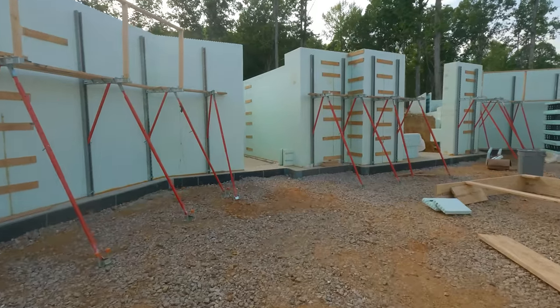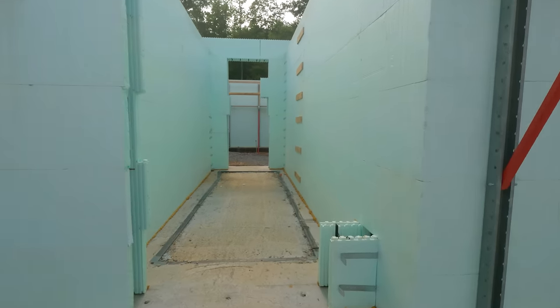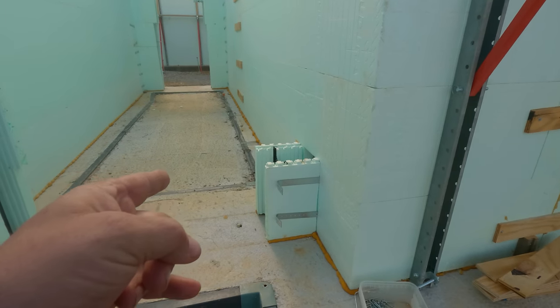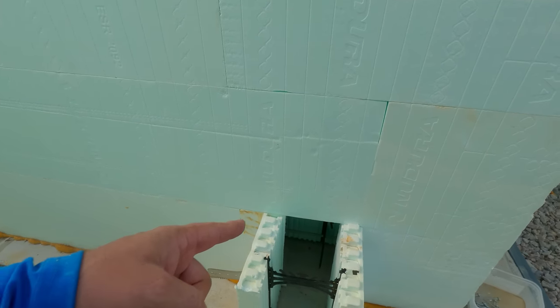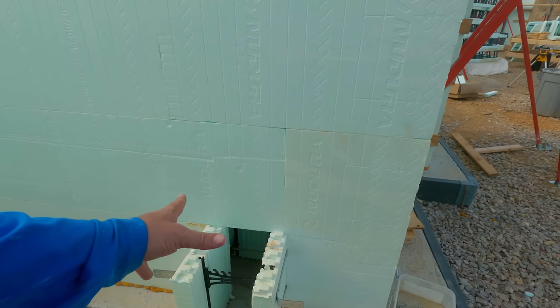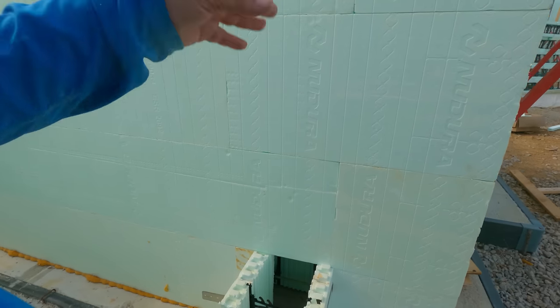All right. So I've made an executive decision over here. This is the hallway to the theater. This was supposed to get a door on the original plans, and then I was going to do a cased opening here, but I'm going to get rid of that little stupid jut out. So that means I will have to fill that one hole that we've already cut for the T-wall. And I will probably put a square of plywood here that will seal that off, and I'll put it on the backside too, since that's a little weaker to bulge out, since it doesn't have the connections there.